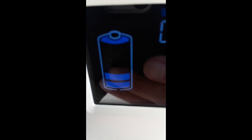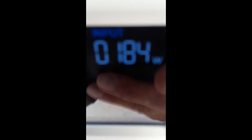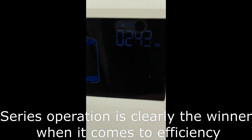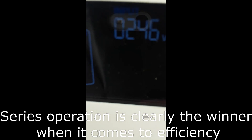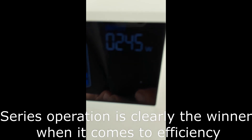For the current conditions I have the two good panels out back running in parallel and they're charging at 185 watts, which is not great because these panels are each 170 watts - so parallel operation isn't great right now. I switched it to series and the panels hooked up in series hit 246 watts, which is the highest I've seen so far.